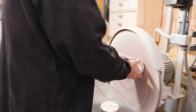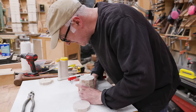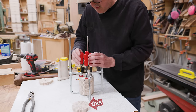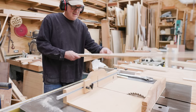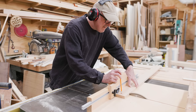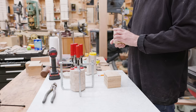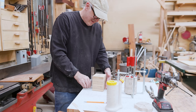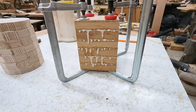Once the rings were glued up I sanded all the faces, the same process I always use, then glued all the rings together. I didn't have to worry too much about the center as that would be inside the mallet. I made one special ring with all pieces grain-rotated to put on the end of the head. Another idea for a decorative head was to glue pieces of bamboo plywood together — the same bamboo I used in the kitchen and on the Death Star project a few years ago — basically just gluing up a block of it.